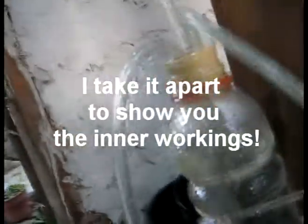Everything worked fine and it refilled. This is a U-tube down to here — this acts as a valve, and a pretty reliable valve, because basically you're going to have more pressure than that before the valve blows. The pressure to blow the valve is less than the pressure it takes to pump the water up to here. We're actually only pumping from here to here but this is just a demo to prove that it works. So the U is the valve, and the yeast is pushing air down to there and it's pushing water up into this.